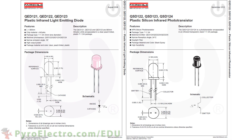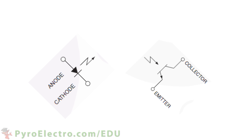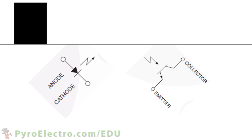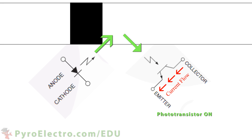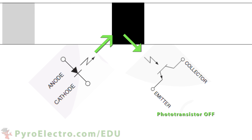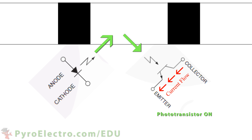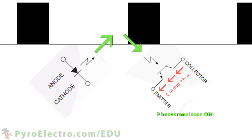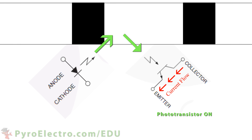To create an infrared encoder sensor, we take the infrared LED and combine it with the phototransistor. Then we cycle two colors in front of the sensor. If the color white is in front of the sensor, the infrared light will reflect almost perfectly and the phototransistor will turn on. However, if the color black is in front of the sensor, much of the infrared light will be absorbed and the phototransistor will not be able to turn on. By using this type of reflectivity sensor we can make black and white colored encoders for feedback into systems so that they can easily track movement.